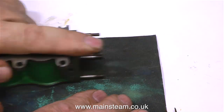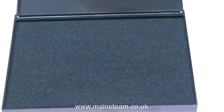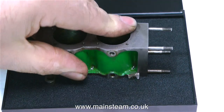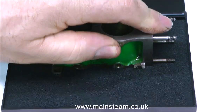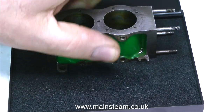I'm taking this opportunity to clean up both of the faces of the cylinder block on some fine sandpaper. What's on screen at the moment may also look like some sandpaper, but it's not. It is an ink pad that I bought a while back. Every workshop should have one — it's a very useful tool for duplicating things. I'm turning this into a printing set so that I can print the impression of the cylinder block on some gasket material.